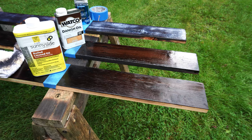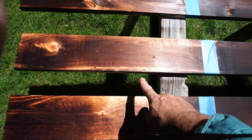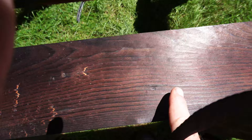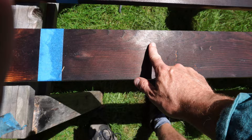We're going to let that all soak in and settle for the next 20–30 minutes and I'll come back and show you the final result. Approximately a half hour has passed since I oiled and polyurethaned these. This is the light end — we had the linseed oil, Danish oil, and polyurethane. This is the mid-burn section — probably my favorite way to do this. It's got that nice matte satin shine to it. The grain of the wood is really brought out. The Danish oil was a little bit thinner; the linseed oil was thicker and soaked in a little bit slower — I kind of like that.